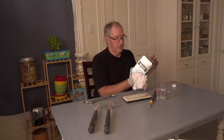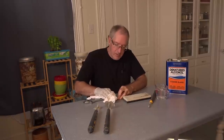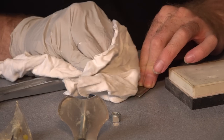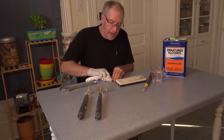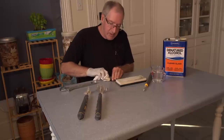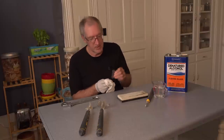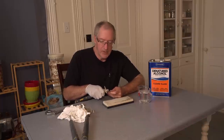I have my glove and my denatured alcohol. I'll get the cloth wet and try to dissolve the shellac that's gotten on the blade. This is an important step to make sure it's completely clean because we don't want to contaminate our sharpening stones. The alcohol does dissolve the shellac - that's what it's there for - but this has been crusted on and exposed to heat which makes it even crustier. When these tools came from the factory they were razor sharp - you could cut yourself. If there's a little bit that won't come off, I use the edge of another tool to gently pop it off.